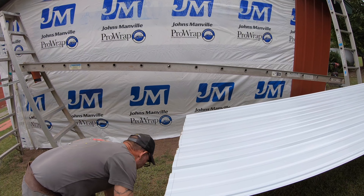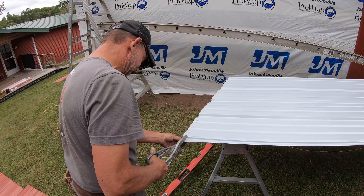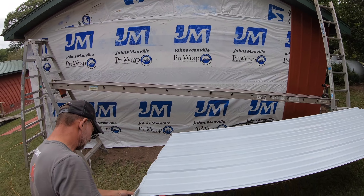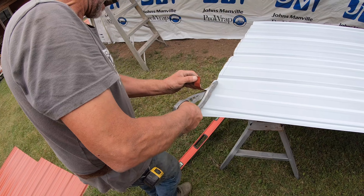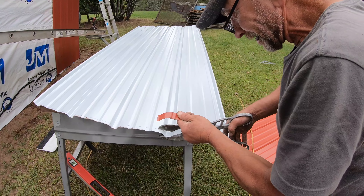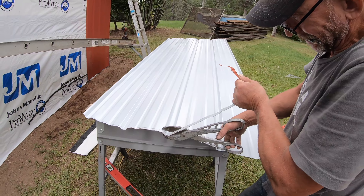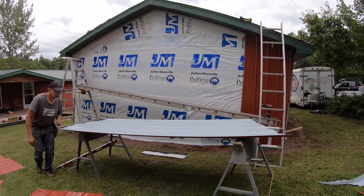We're going to watch how Frankie cuts this. Are you using a left, right-handed, or center-cut straight-cut tin snips? He's using straight-cut snips. When you're cutting out a corner, then you have to use the left and right. Frankie's not wearing gloves because he can't hang on to the tin with them — but be warned, this stuff will cut your skin, it is sharp.